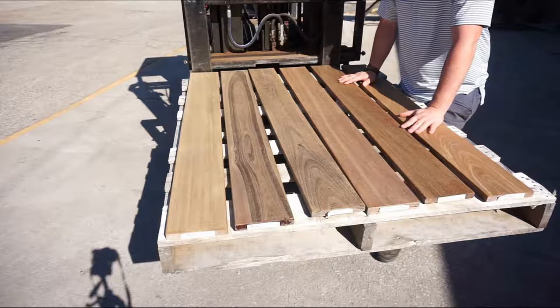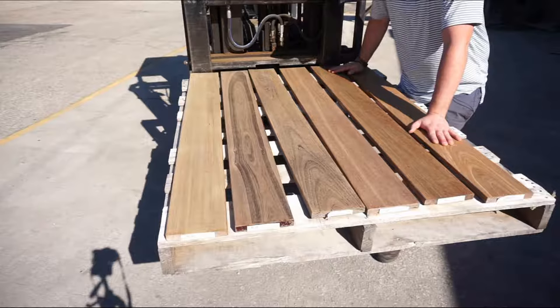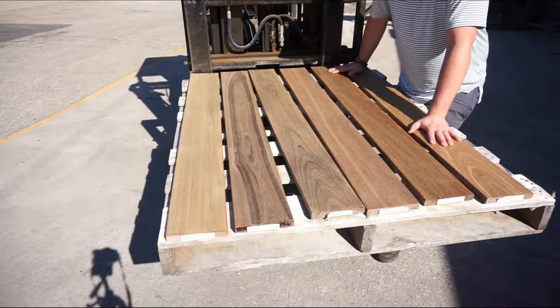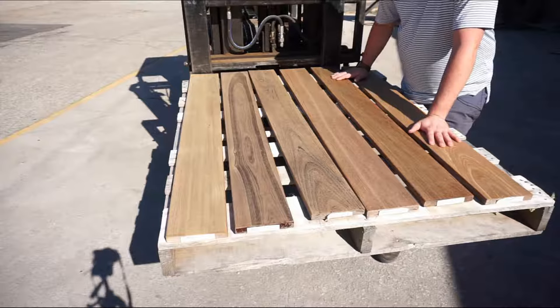I have the boards down here — I took them off the roof after 12 weeks. When I first put them up there, I put a thin layer of Mesmer's UV Natural on all of them, on the whole board. As you can see, they've grayed out substantially. On a rooftop, they are certainly exposed to substantially more sunlight than they would be on a typical deck. Typical decks have at least some shade from either the house or surrounding trees. I wanted to hasten the process to show everyone what happens when boards are exposed to sunlight, even with the oil — because had I not put the oil on, this would have happened a lot more quickly.